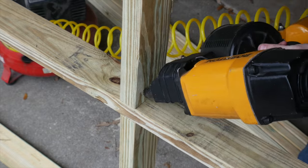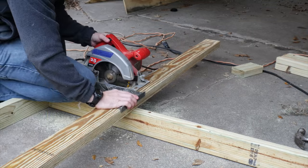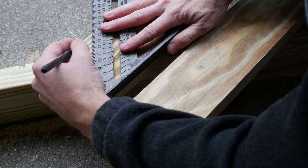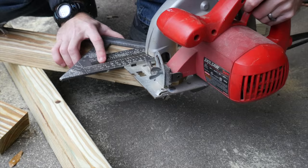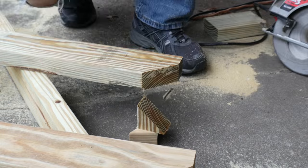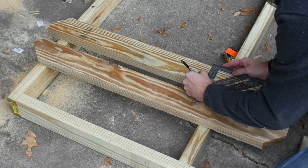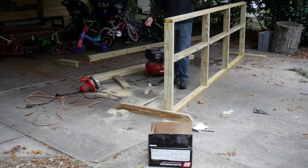That's just a matter of shooting in a nail at an angle. Next, I cut two feet to hold up the frame. I used a scrap to draw a line and then drew a 45-degree angle up from that point. Using the speed square again, I was able to cut off that miter on each end of each foot. From here, I made a mark where I wanted the feet to sit on the frame and then just nailed them in place.